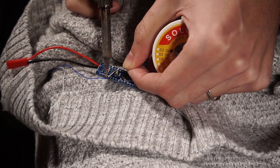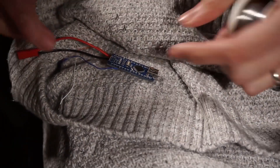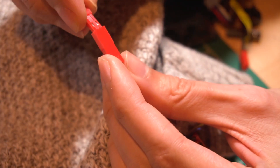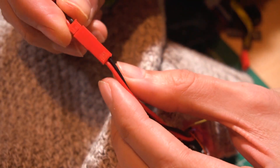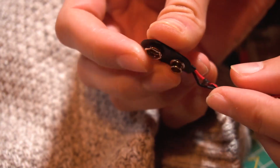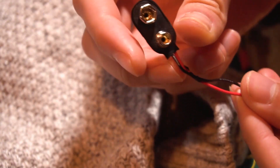Upload to your Arduino and remember to solder the set of wires to it. I also connected a JST battery connector — you can use whatever connector is convenient for you. Just take into account the voltage you are going to use for this project and do not exceed about 11 volts to be safe. Now it should work without problems.